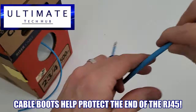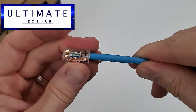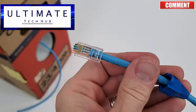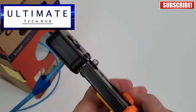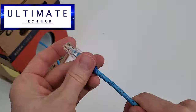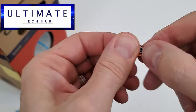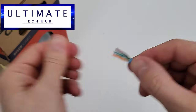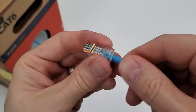Add two boots before you connect the RJ45. Go ahead and slide the wires into the RJ45, then use the crimping tool to secure the connector. To save time, I'm only going to show you how to make one cable since the process is the same for both. I am using the easy RJ45 connector as well as the easy crimping tool — if you're new to making patch cables, I would recommend both of these.